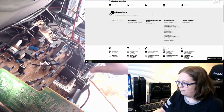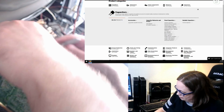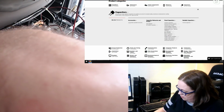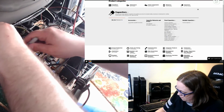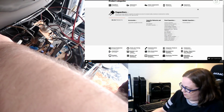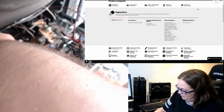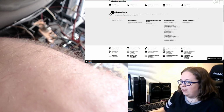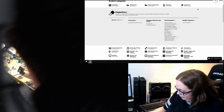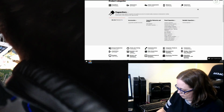Almost done with the middle. Protect your neck. 50 volt 10 UF C807. 16 volt 220 UF C952. What was the C number for just the 10 microfarad one? C807. Sorry, thanks. I started writing 50 microfarad instead of 10, like 50 volt. Numbers are hard, kids. 16 volt 100 UF C802.